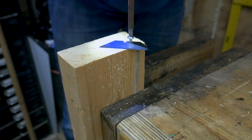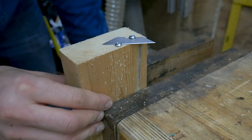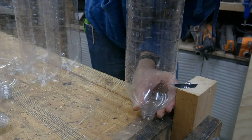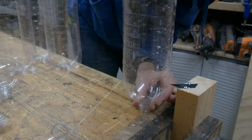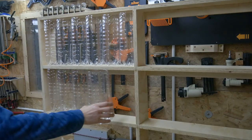When making this storage rack, we made sure that every shelf was exactly the same height, and this was 270mm. Now we need to cut the bottles to the right height so they fit nice and neatly on the shelf, and we want to make sure we minimise that gap so that no dust and dirt gets into the nice clean lids. So we made a quick jig where we screwed a cutting blade to a block of wood, set at 265mm, spun the bottles round and cut the tops off. Using the jig keeps the bottles at a consistent height, making them look really nice and neat on that shelf.